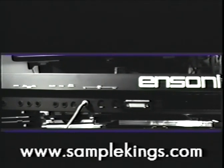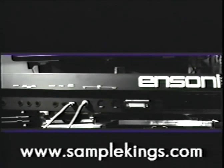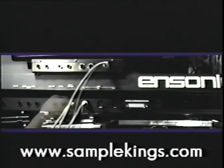Directly next to the MIDI in is our output expander port. The output expander is an optional device that is absolutely necessary for your hip-hop production. It gives you an additional 3 stereo pairs for routing your samples separately to the board. Now this is very important when you go to the studio. When you get to the studio, and you plug your EPS up at the board, and you can separate your samples, then you could drop them out at will without having to sequence them. So this will save you valuable time and money.